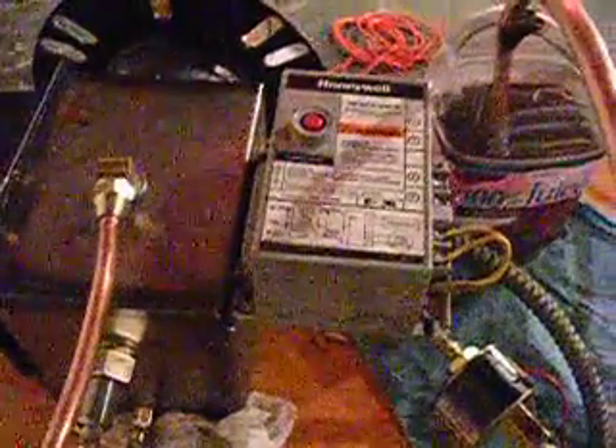This is the time delay, a typical device that's on a burner. That's the 10,000 volt transformer that creates the electric arc. The waste vegetable oil is drawn out of that container through this copper tube, into that safety valve, filter, pump.